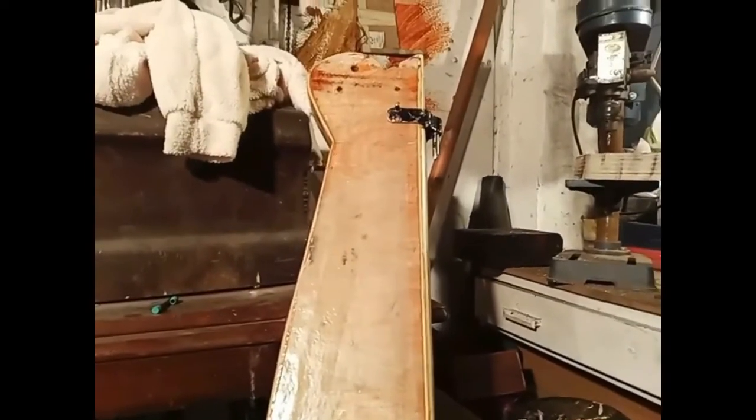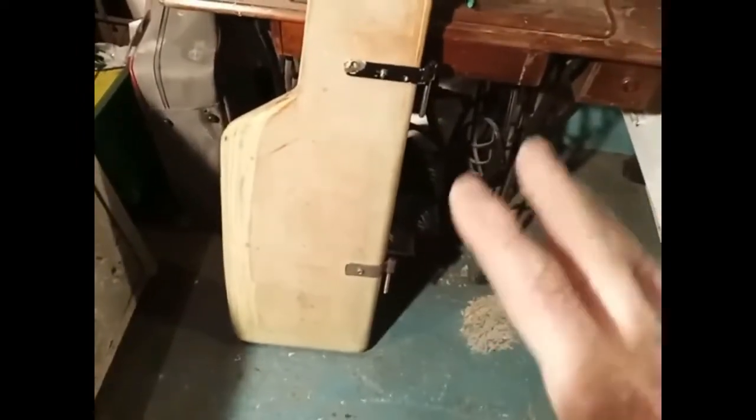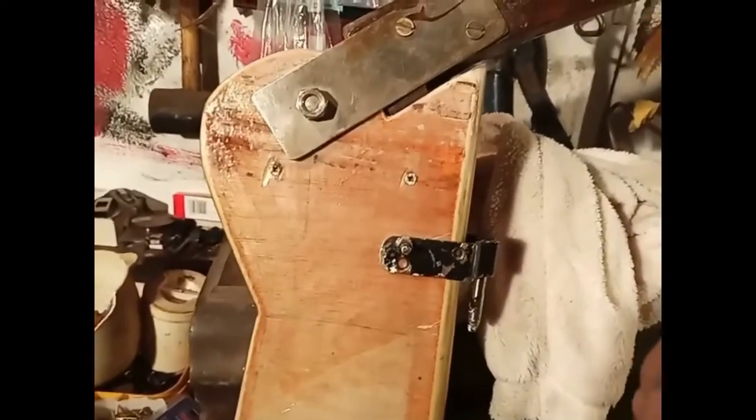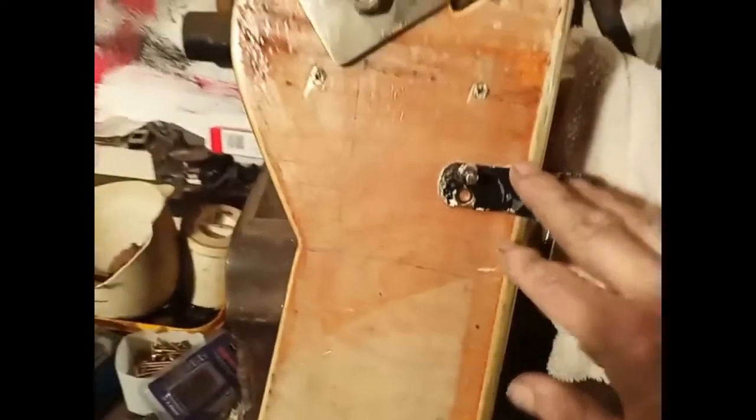They just need putting on the boat, fixing in place and tapping, and then the screws putting in so they're all lined up perfect, and then taking back out and resealing watertight. Well, these two aren't a problem, it's the bottom one that needs to be really waterproof. I might put him on now and actually back while I'm here. He's perfectly sealed.